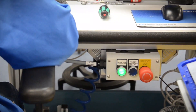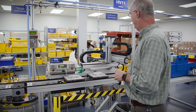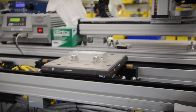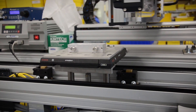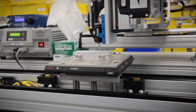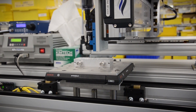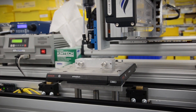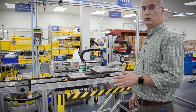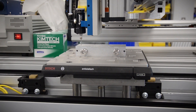Keith tests for those parameters, then hits his release button and the unit is sent over to Sealing, which is a three-axis Cartesian robot. It's fully automatic — no need for humans to interface with it. In the past, we used to do this 100% manually. Now it's done robotically, thanks to the lift and locate from Airline Hydraulics, which holds the unit within plus or minus two on the XY-axis, ensuring the sealant goes to the exact parts of the unit that we need.